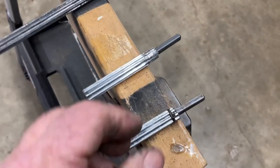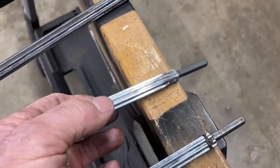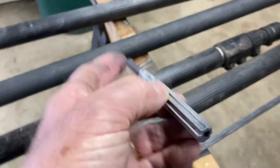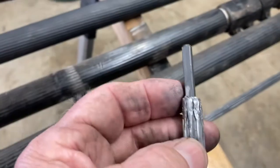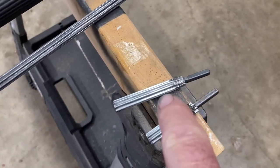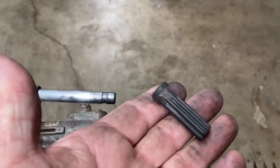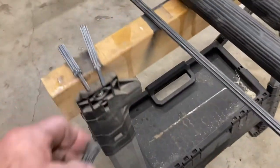I reused the metal square stock tips to make these new aluminum pieces. I slid them in, but to do so I had to do some grinding on a piece to make it fit in the hole. It's a little smaller than the tip, so I ground them down to slide them in, and then they stopped at the point where I stopped grinding, which is perfect because they don't slide all the way in. That seems to work fine. I'll have to buy some square stock that's about the same size to make that work for the next ones.